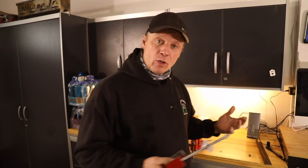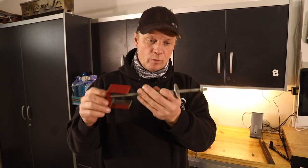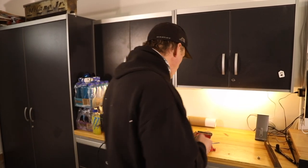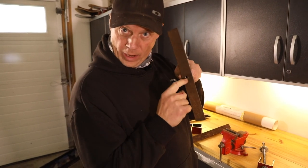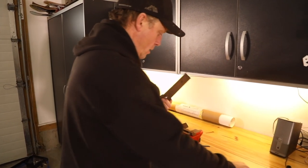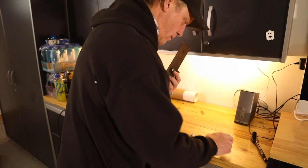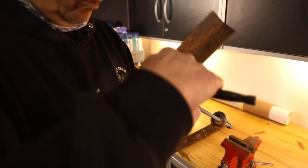You can go down to your local hardware store and get some threaded rod. For today's purposes we're just using 3/8ths because it's all I had at the moment — I highly recommend half inch because it's stronger. There's a lot of tension on those springs and them clutches, and you don't want to hurt yourself. So you're going to take that angle iron and drill a half inch hole. We're going to get some bolts and washers and put a bunch of Loctite on this sucker. Make sure you put lots of Loctite on — right now we have blue but I highly recommend red. We're going to tighten this up.